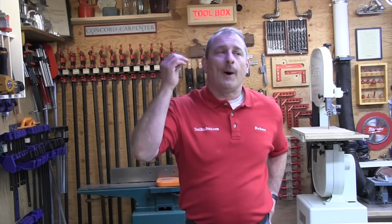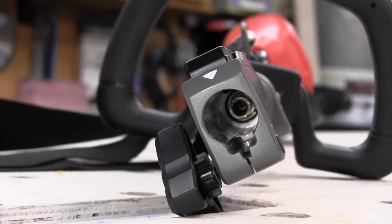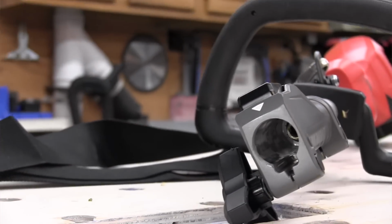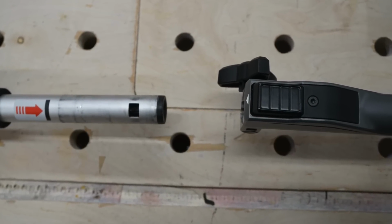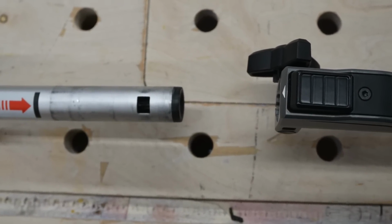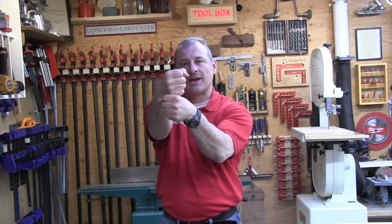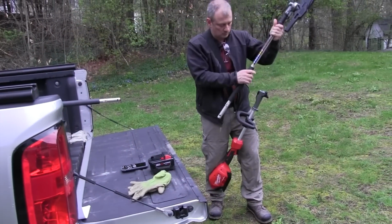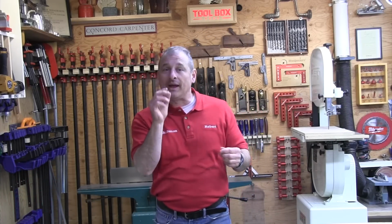The power was awesome. On small, there's one small fitment issue I do want to talk to you guys about. I noticed the indexing from the accessory pole into the power head shaft. The accessory pole just should slide straight down, and there's an indicator line and an arrow. And a couple of times I had difficulty fully seating the Torx-like drive shaft male-female connectors. And when I looked at it closer, it seemed like they just weren't lining up. So sometimes just a little bit of a rotation got them to insert quickly and easily. Other times I couldn't get it to move, so I just cycled the trigger for a second just to rotate that head a little bit, and the power head receiver moved just enough that it clicked in. Just something to be aware of.